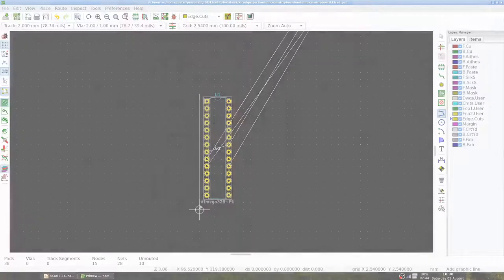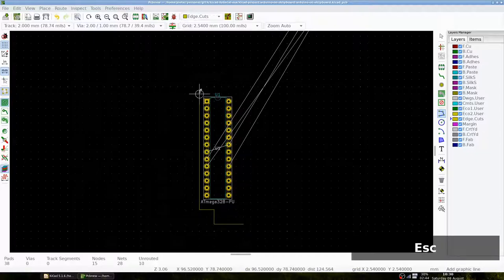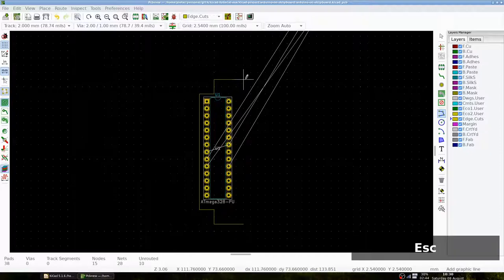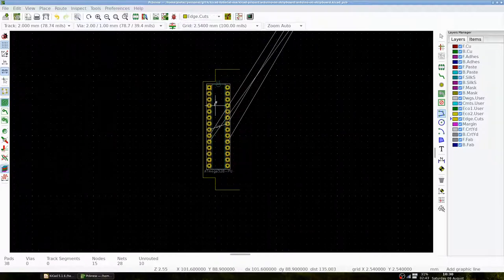My stripboard has corners without strips and holes. So let's take that into account in the corners. Horizontally, I can place two Atmegas and have two holes left, so let's place the Atmega in our layout and draw a horizontal line alongside it.